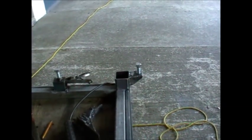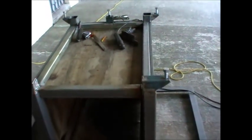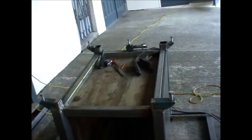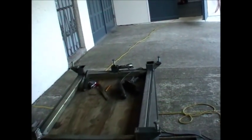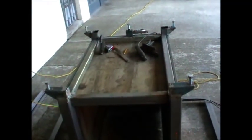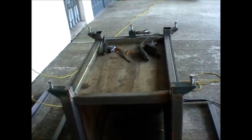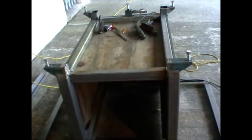That clearance is there for safety since we live in an earthquake-prone area, but it's also just a good feature to have in case somebody were to climb on one side or the machine was unevenly loaded. It could temporarily rest over on those outrigger feet, which are nothing more than safety feet. So essentially this is also a three-foot design, which does not allow for stress transfer through the carcass of the stand or base and into the machine and the alignment of the slideways.